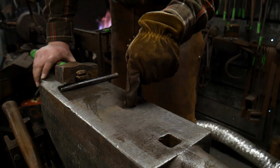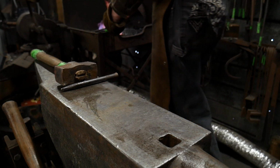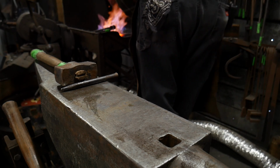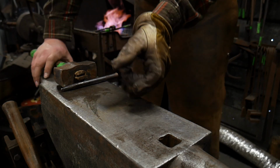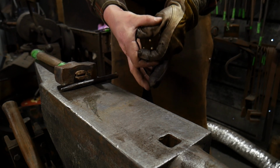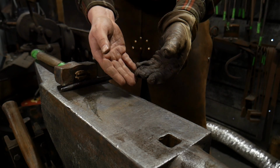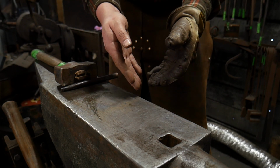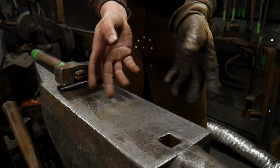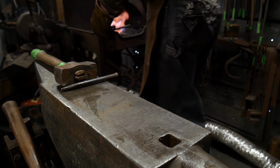Without it, it just looks like you punched a hole and tucked it. You just did a simple tuck. That's okay, and that can be decorative in and of itself, but in my opinion it generally looks better if you can keep the opening of the pass-through hole as close to the original parent bar dimensions as you can as your piece goes through it. And once you've accomplished that, as it goes through, do something different to transform the material on the other side of the hole. That's what makes this look so effective.